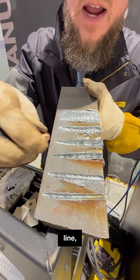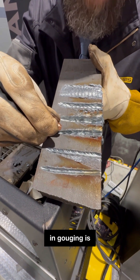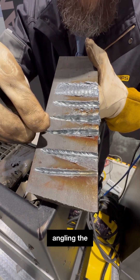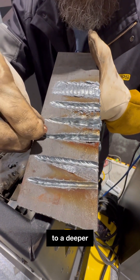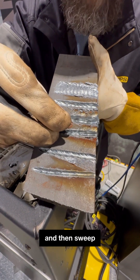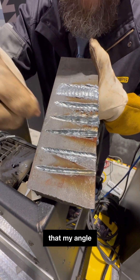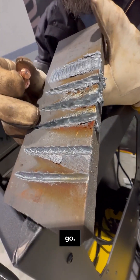The third one down the line, I'm actually producing more depth. The way you produce depth in gouging is by angling the angle of impact to a deeper level. So if I draw that tip back and then sweep forward, draw it back, sweep forward — you can see that my angle of impact is much steeper the deeper I go.